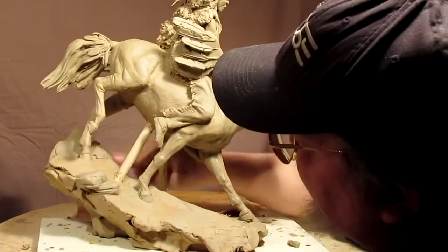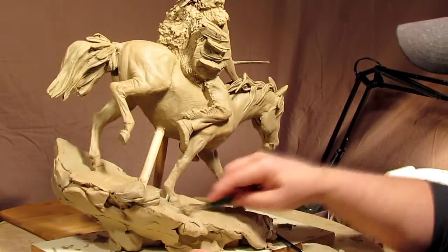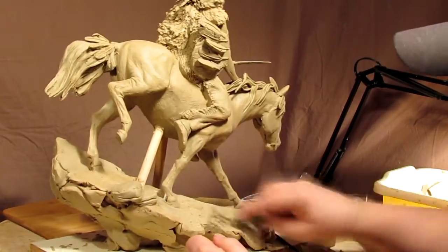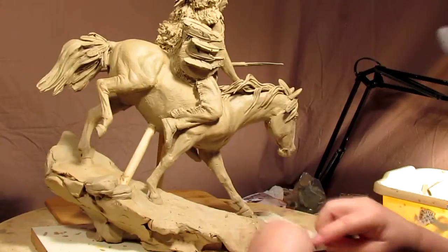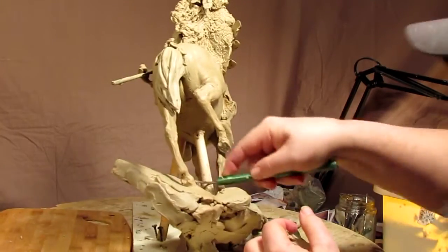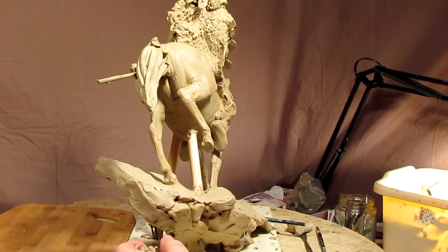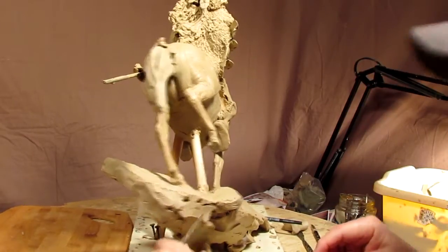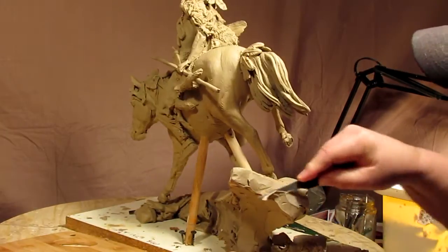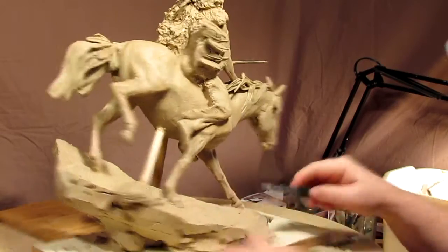After they break the ceramic mold off of the finished bronze, the ceramic mold is a destructible mold. And so it's going to invest itself in the deep crevices. And so you can still have, without compromising your work, the crevices, but you just round them. And when you round those crevices with a tool like this, the investment just pops right out, because there's nothing for it to hang on to.